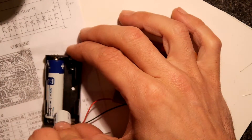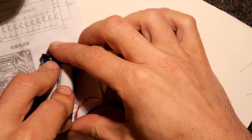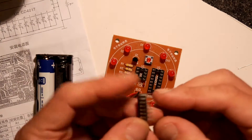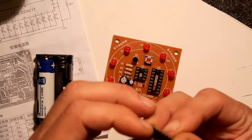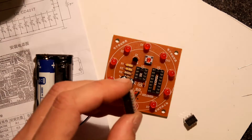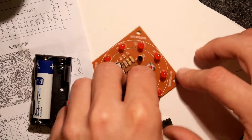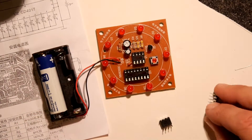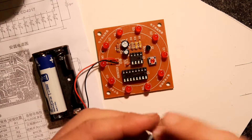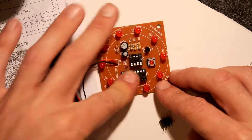Battery in - oh wait, we didn't put our ICs in! With ICs, you shouldn't touch the pins because static electricity can destroy them. If you're next to a radiator like I am, just touch the radiator before you touch these things to discharge static. I've been handling them so long I can't remember being worried about static. This one doesn't want to fit into the holder - push them on the edge of your workbench slightly to straighten and align the pins; they're a little splayed to start with. There we go - it goes in.